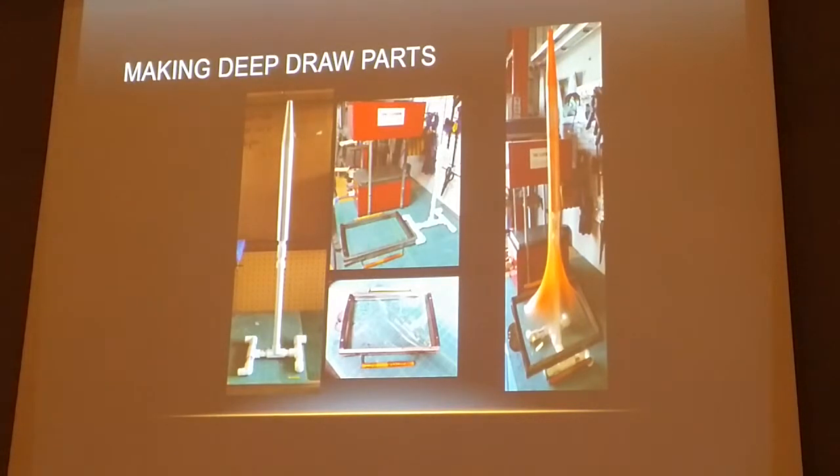The big problem was how do you draw some of these parts? Figuring that out really took over the course of about two or three years, and every time I would do it, it seemed to get a little bit better. I have a big aluminum mandrel that I set up on a stand. The key thing is you heat the plastic up and you've got to find the golden Goldilocks factor where it's just right — not too hot, not too cold. There's a certain temperature where it hits the flow rate. I literally pull it out of my heating frame, move it over, and then draw it down physically over the mandrel.